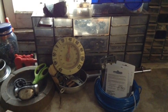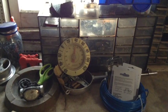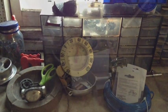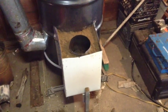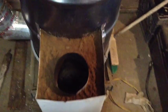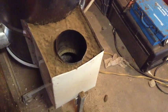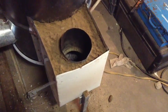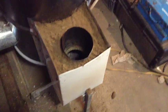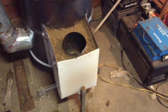In a few minutes I'm going to demonstrate lighting the rocket stove heater. The temperature in the garage now is 40 degrees. I added this little box here and surrounded the feed tube with sand, because at times it would burn real hot and this isn't really thick gauge stuff. It would start glowing red, and if I stepped out for a few minutes I didn't want it to break off and have a bunch of hot coals go out on the floor. So I put that there as a little safety feature.